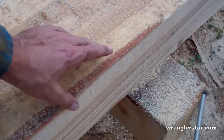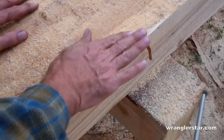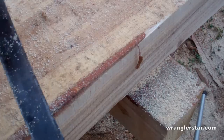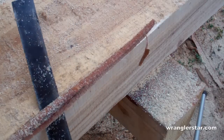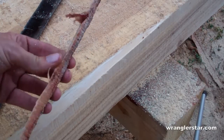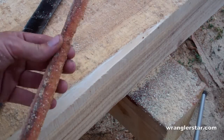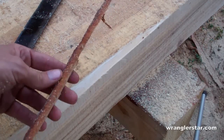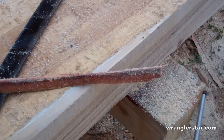Since we're cutting square timbers out of round logs, they're imperfect, and once in a while we'll get into the bark of the wood - the round portion - and this is called wane. How you deal with it is simply use your draw knife with the chisel edge down and you can very carefully cut that off. It's very effective and works quickly. You want to take this wane material, this bark, off because bark draws bugs. Firewood logs sitting too long get infested with bugs - mostly because of the bark. They'll get in the bark and burrow in there. Don't leave firewood more than a year or two or you'll get a lot of bug problems, and when you bring it in you can get an infestation in your house.